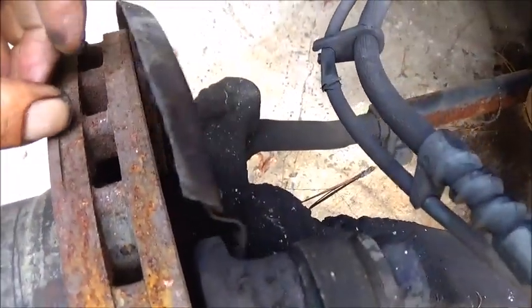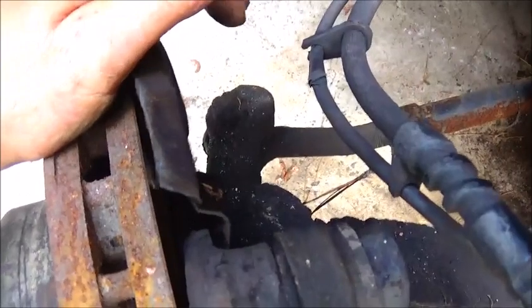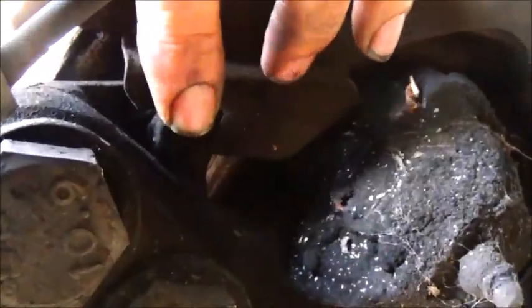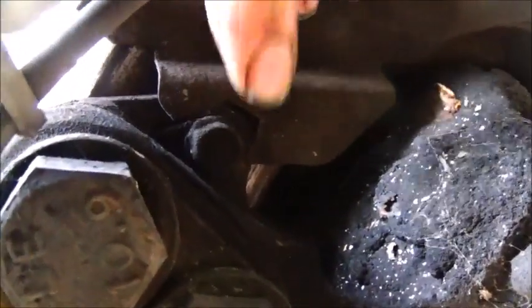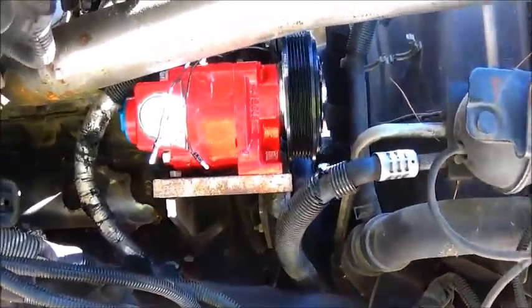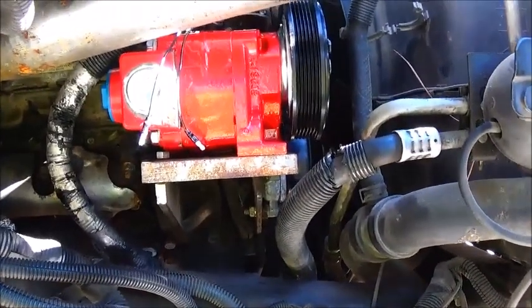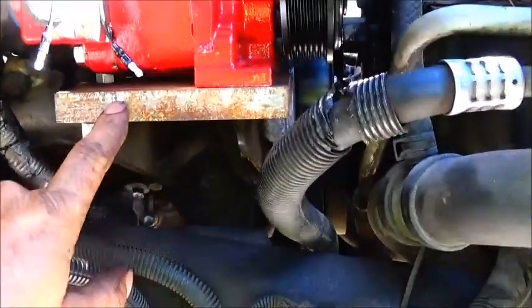I just happened to hit this and I heard that — that would be an aggravating thing. Looks like we'll have to pull this bolt out right here, put a washer on it, and then maybe weld it into that cover.